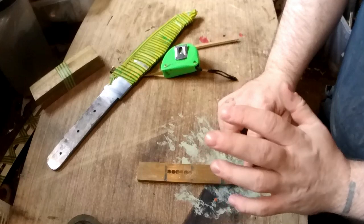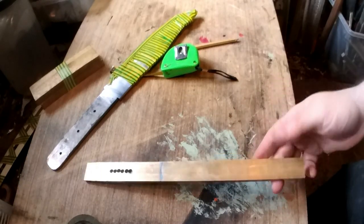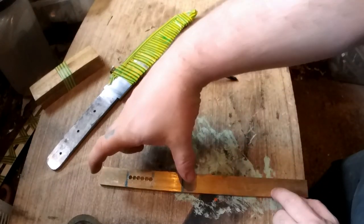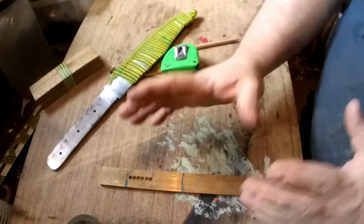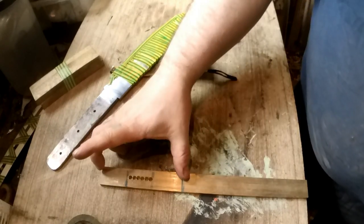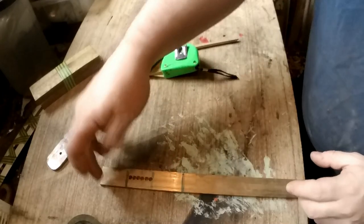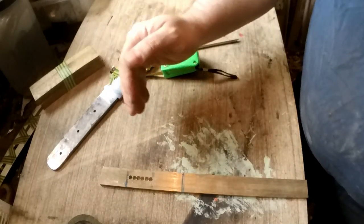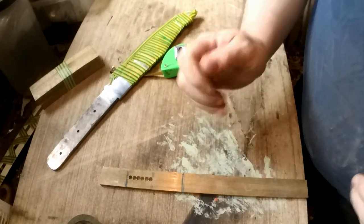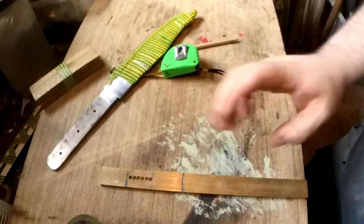I've only ever had that issue with brass. It must catch on the drill bit. So you either want to leave it in a big bit or screw the smaller bit to a piece of wood, which you would have seen me do in other videos. If I'm ever using anything small, don't try and hold it, especially brass. Screw it down to a big piece of wood that you can have a lot of control over, or clamp it to your drill.